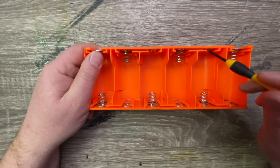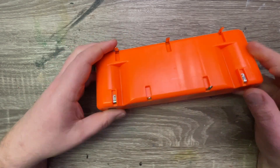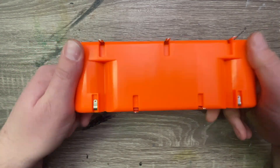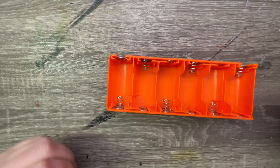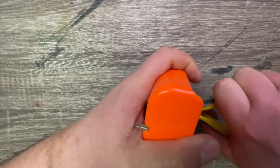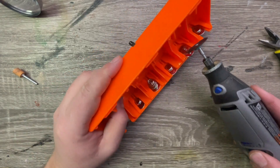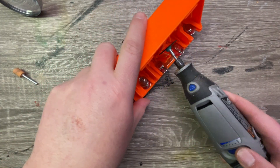So we want to remove all of this stuff — we don't need it. We're going to Dremel out a big space in our tray. I'm going to leave this contact and this contact because I want this to be an option that will slot right in without any modding. We've pried up our tabs. Let's see if we can force these out a little bit — need some pliers. I've certainly had these come out easier. Maybe it'll be a little bit easier if we do some cuts in here. Dremel, always a handy tool. I'm basically just trying to cut out this bit that is holding things in.